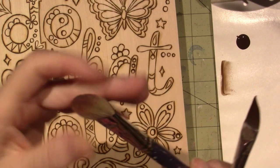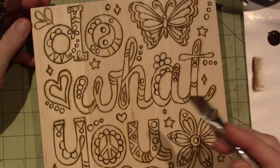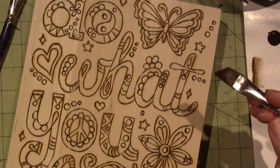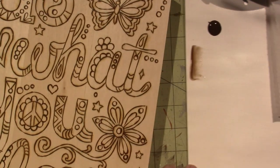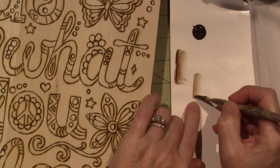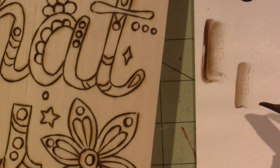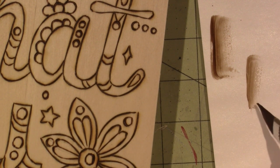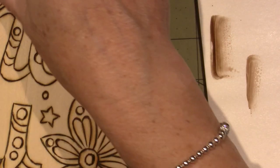Lately I've gotten to be a much sloppier floater — I mean I'm not as worried about it as I used to be, and maybe I'm just better at it. I also want to show you that you can pivot the brush, because when you put it down on the surface it leaves a line there where the water stopped. So you have to pivot the brush and tuck it up against the edge.